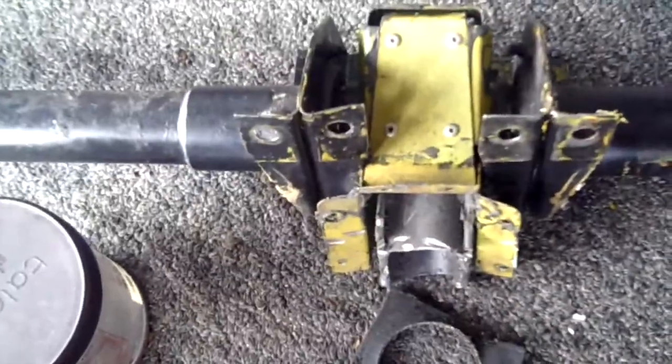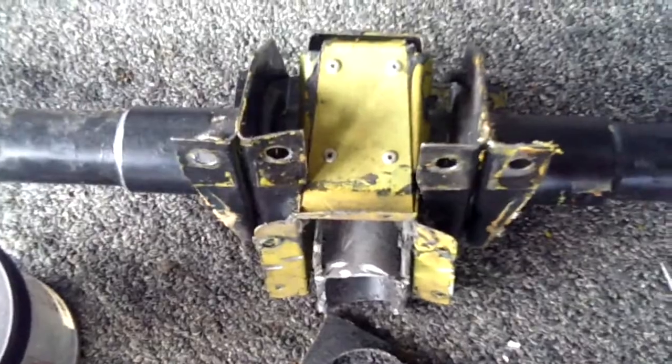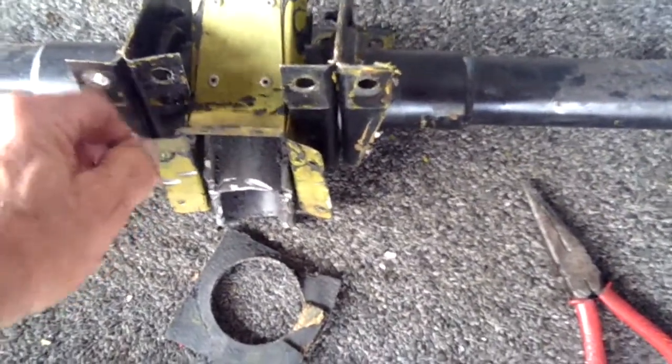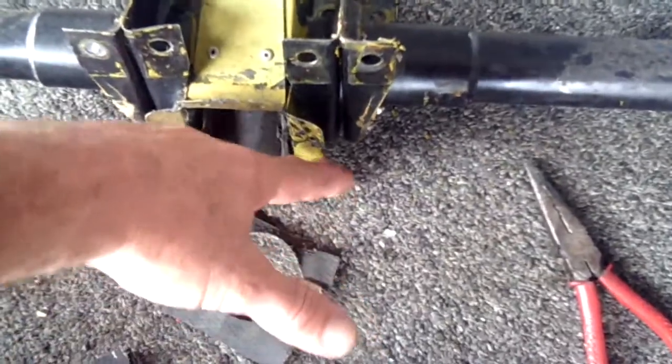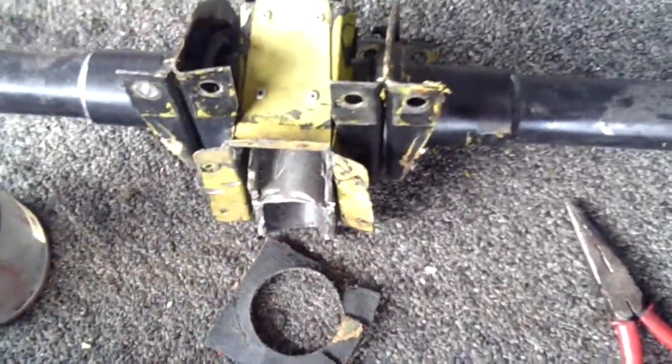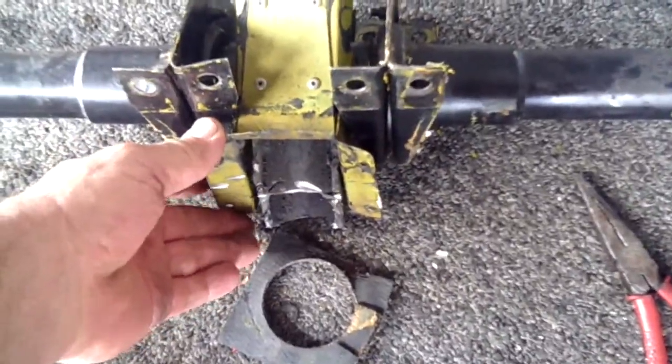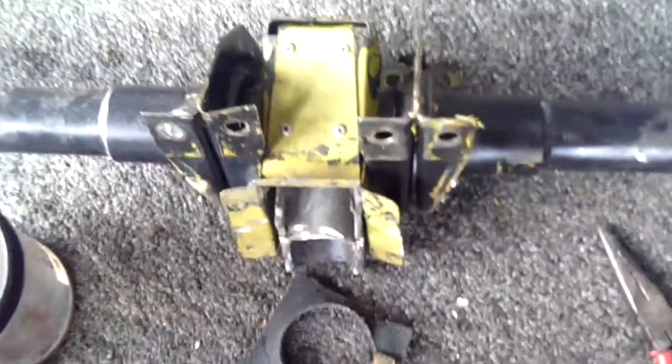So now we're going to go ahead and put the little heat shield box back in place. And what this does on the 77, 78s, and 79s, it prevents the hot air from the cowling coming up through where the torque tube is and flooding the cabin, what feels like cabin heat. So this whole blocking assembly is just to keep the hot air of the cowling on the proper side of the firewall.